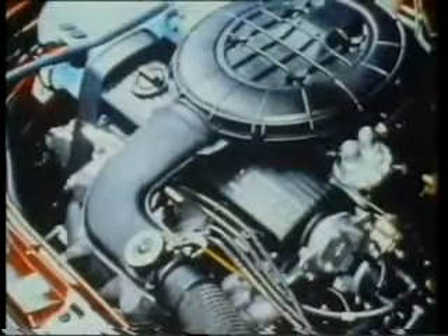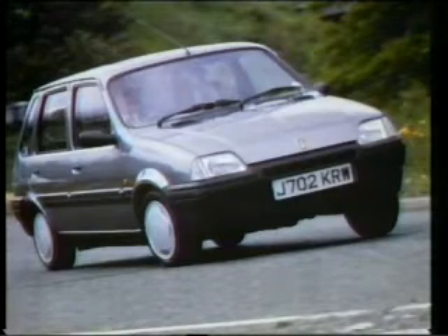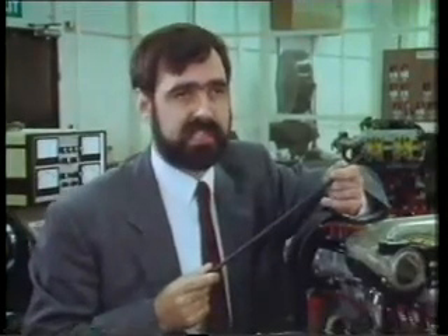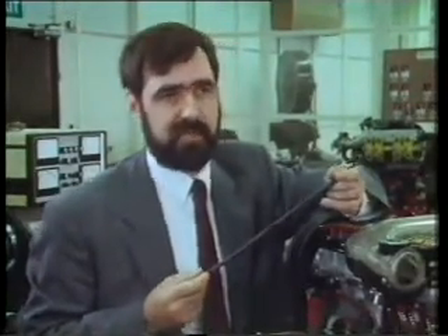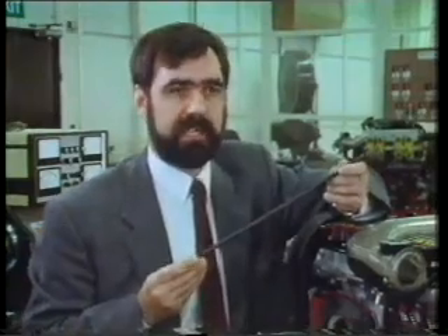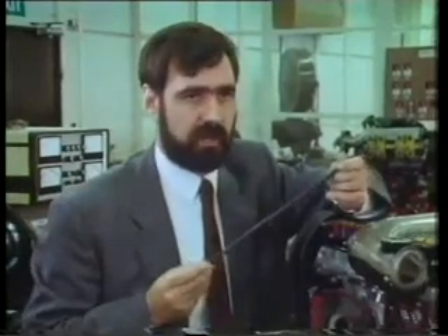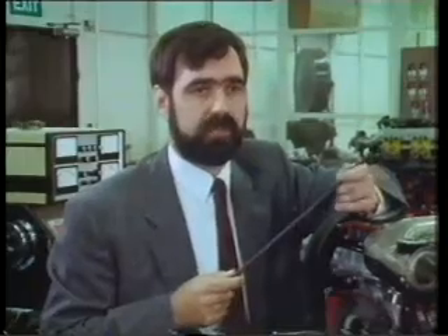The first engines were launched in 1989 and 1990. It has indeed been the engine designer purist's dream for many years. The thing which has made it possible for the K-Series are developments on the materials front. The bolt itself is made out of a boron steel with a very closely controlled yield strength. Without that closely controlled yield strength, we would not be able to maintain the load applied by the bolts within the close limits that we need. And without those close limits, the flexibility and the loads applied on the engine would be non-uniform, inconsistent, and would cause us problems throughout the structure.